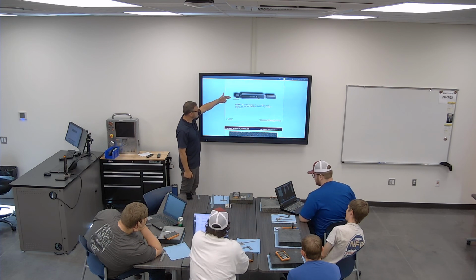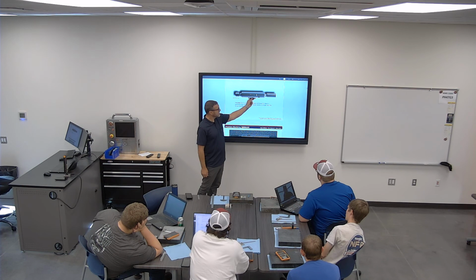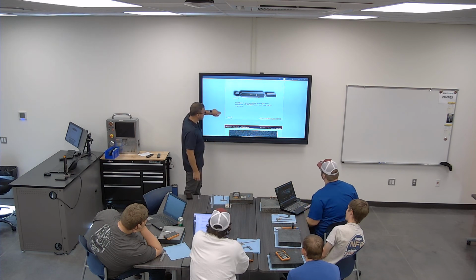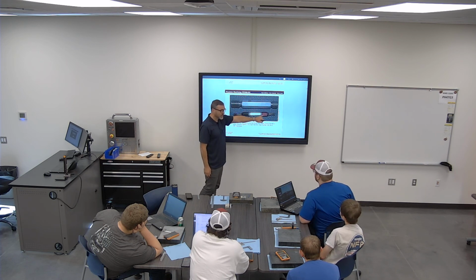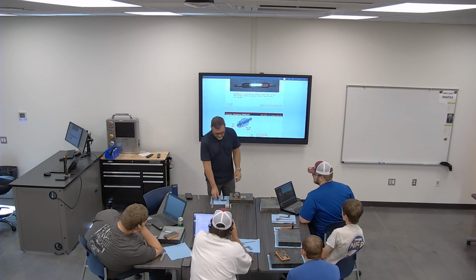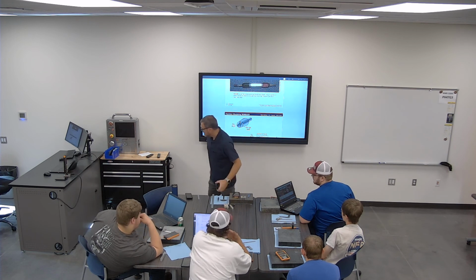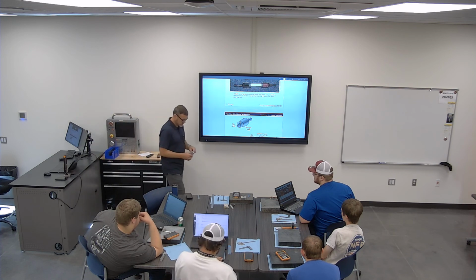And here's a picture of one. Same thing as this, but it's just got a pin, basically a dowel pin, on either end. And here, thread gauges. Red is no go, green is go. When you say no go and go, that means that one thread will go in, but the other one won't, right? Exactly. So if the no-go does go in, you either have too big a hole, or you got the wrong size.